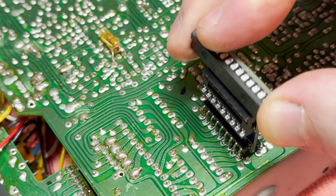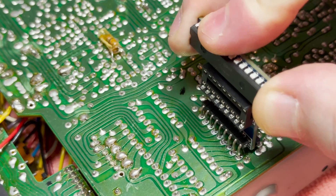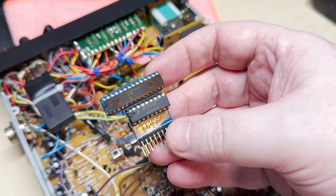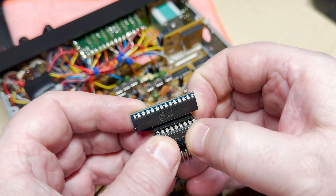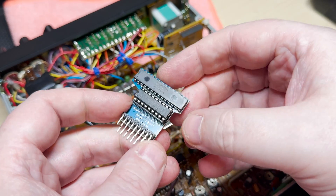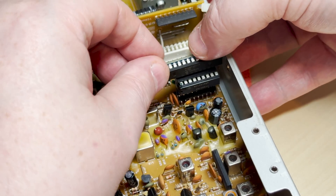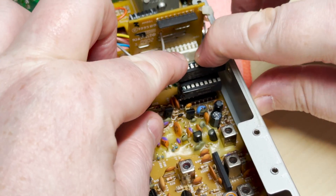On the underside of the board we just do a test fit — make sure all the pins are lined up. If you need to adjust any of the pins, this is the time to do it. Place the PLL chip onto my mod board observing the correct orientation: as you look at the front of it, the notch is to the left — it is printed on the board. Then offer the PLL and place it through.